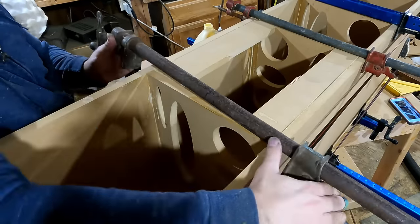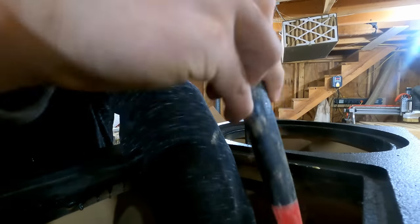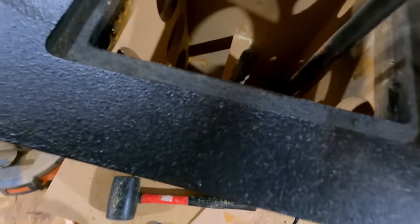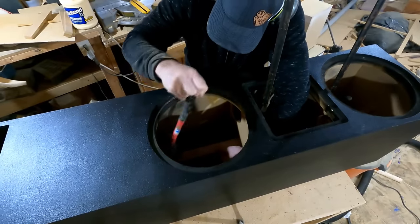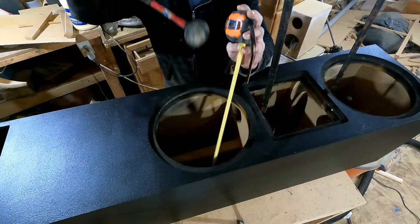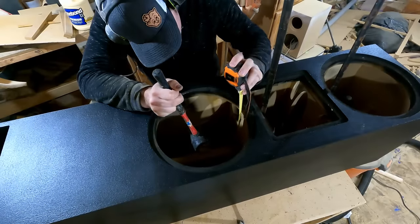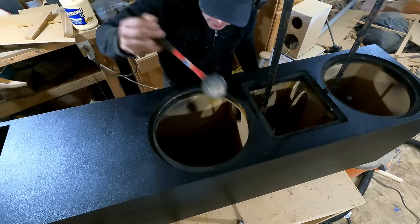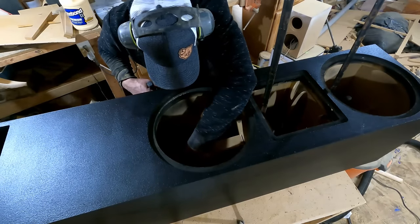In addition to the main braces, I also connected the sides with the top by cutting some MDF into one-and-a-half-inch strips and gluing them in. You don't want these too loose — you want to pound them in gently into place. If they're too loose they won't do any good, and if they're too tight they'll break your braces. Keep in mind you don't want these too high up in the enclosure, or you won't be able to get your woofer down in there. For me, about eight inches worked out perfectly.